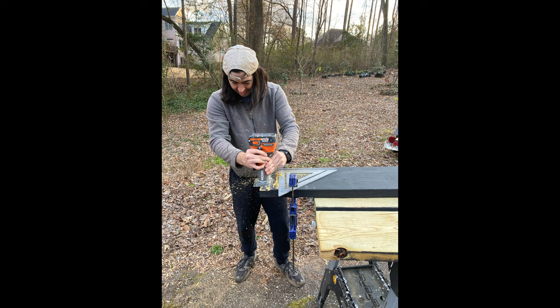Here's me working on the piece of wood. Our C-channels — the internal width — is 1.25 inches, or one and a quarter inches. The boards are an inch and a half, so we had to take off a quarter inch of material at the ends. All these boards are pressure treated two by tens, which is mostly what we're using. We've done before where we did a Shou Sugi Ban, or Yaki Sugi, where we burned them and put a finish on them. This time we just put a stain on it — I think it's Tricorn Black is the color.